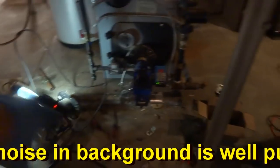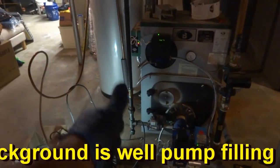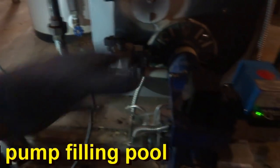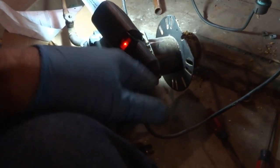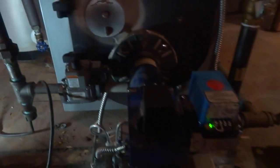take this burner out, put the oil burner back in for now, put a plug in the bottom of that gas shut off. I can put a plug in here and take this out, cap off the red wire, and run this for now till all the oil's burnt out. And then once they call me, they're out of oil, I just come and put this in, hook this back up, the red wire to it, and I'll be good to go.